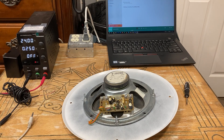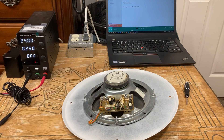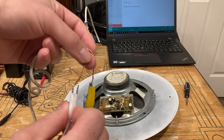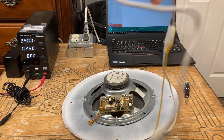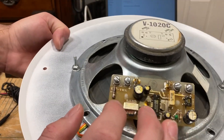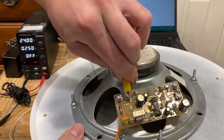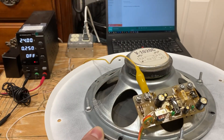Let's wire this together. Starting with the audio — you have your 3.5mm cable. I'm going to set this as my tip, we'll give it yellow, and ground we'll give it white — that will be my ring. On this particular board, this is your tip terminal and this one is your ring. We're going to take the yellow wire and land it on the tip terminal.